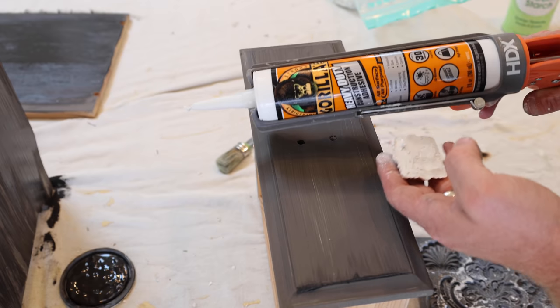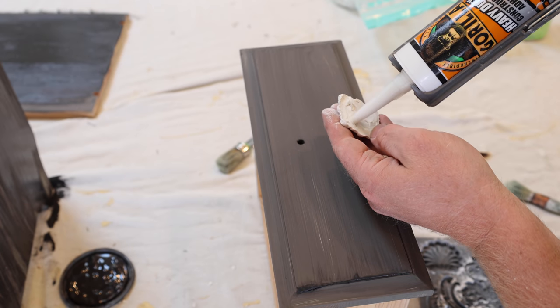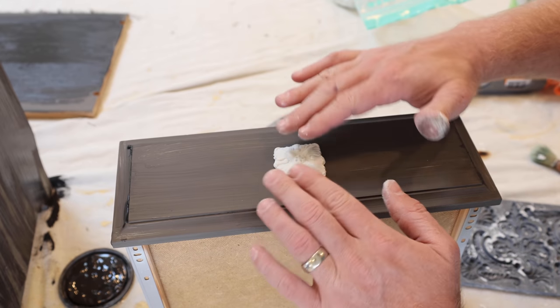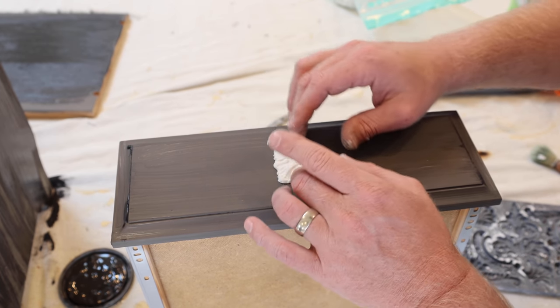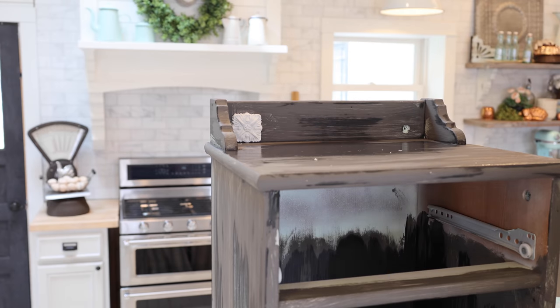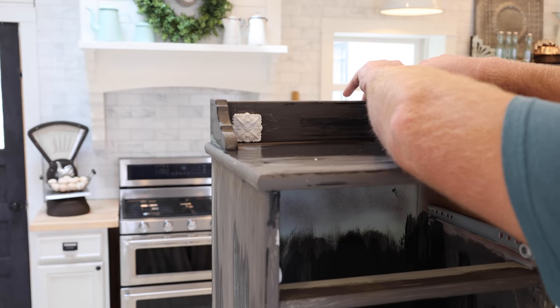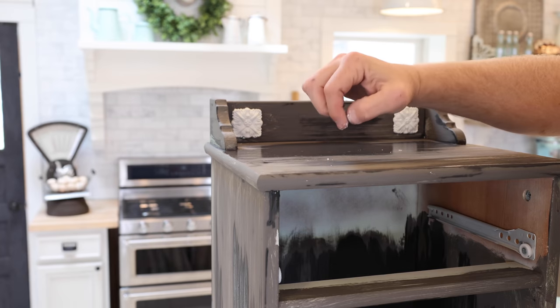This is what we're gonna put on the screws. I'm using Gorilla Heavy Duty Construction Adhesive on the back — we found it works really well and just buy it in the big tube because we use so much of it. It's not quite dry yet on the mold so I'm gently pressing the corners down, then we go over it with the second coat to help adhere it. Pro tip: adding a mold detail also covers the fact that it's a more modern piece with those really weird screws — this is a great way to cover them up.